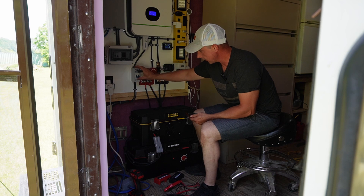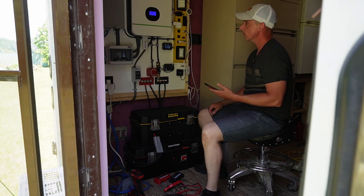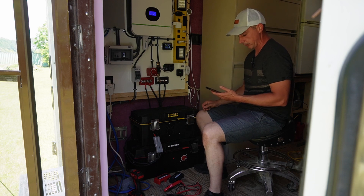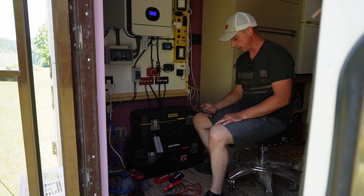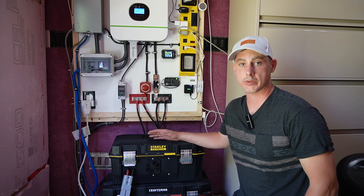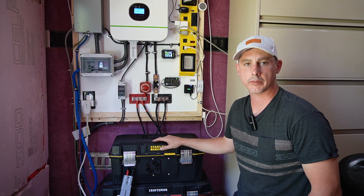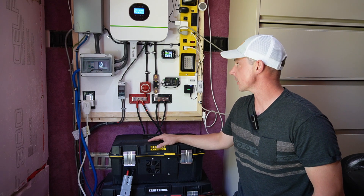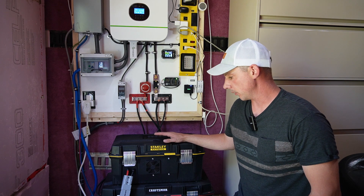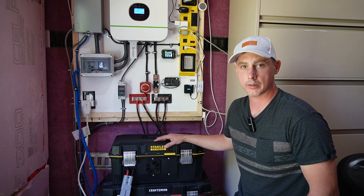Now I can fire back on the Growatt and these two will continue to parallel off of each other. The Growatt's back on — now I'm turning back on the solar power that I had disconnected out at the pole. Solar's kicking in and the Growatt's running perfectly fine. Now these two batteries should even out off of each other over time. I'm firing back on the air conditioner — it's 32 degrees Celsius inside the trailer. Both battery banks are hooked up and the air conditioner is going, none too soon. I've got to reset the Growatt WiFi because every time the inverter shuts off it has problems reconnecting. But everything's running back to normal — now I have about 460 amp hours at 24 volts, roughly 11.75 kilowatts of battery storage. If you liked the video, subscribe and thanks for watching.